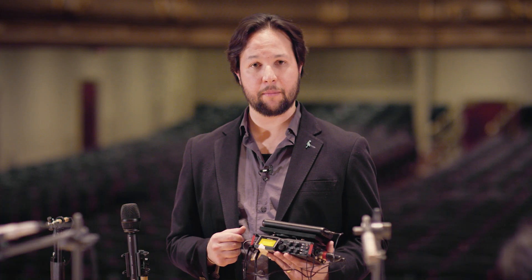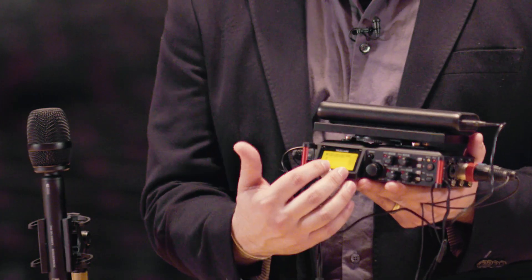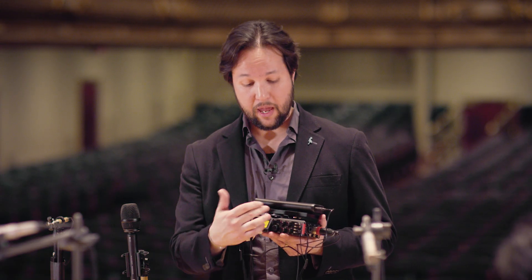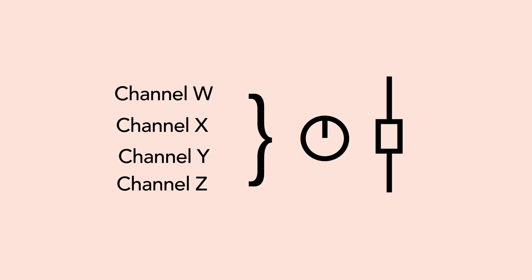The easiest way of recording ambisonics is using something like this Tascam four-channel field recorder, which allows me to digitally control each channel on the recorder, and more so, link all the channels so that with the turn of one gain stage, I can actually turn all four channel preamps up or down as needed.